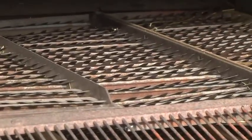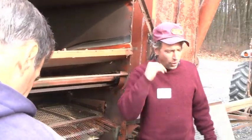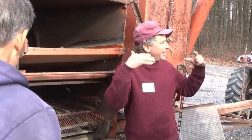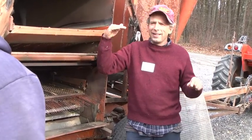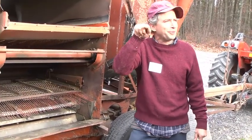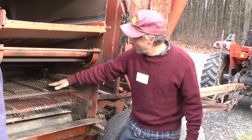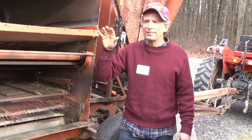When I got my first conventional combine, it was a Gleaner F2, and I was always getting unthrashed heads coming through there, and I got my thing adjusted and I couldn't figure it out. Well, the door that the cylinder bar sat on, someone ran a rock through there, and it had just a tiny dip in it, so those heads would sneak through there unthrashed. I got a new door and new bars, and then I could adjust it, and it worked like magic. So some of these little repairs that Kit could do here are going to make a big difference in terms of how much he's got to do later.